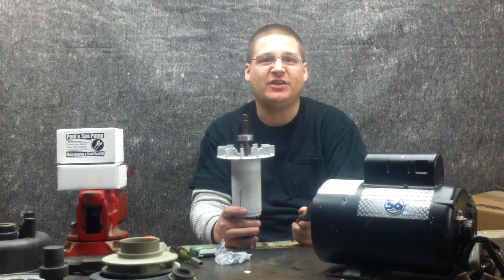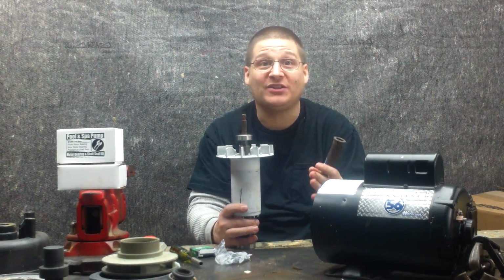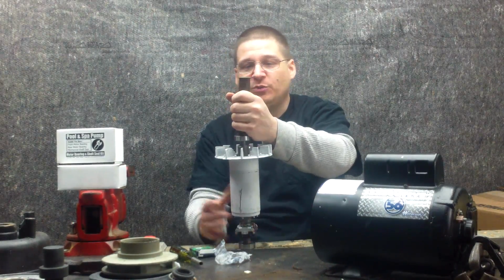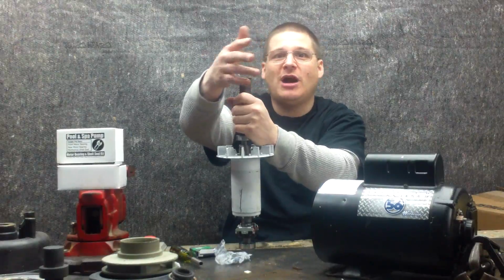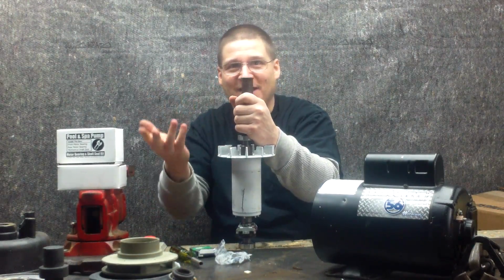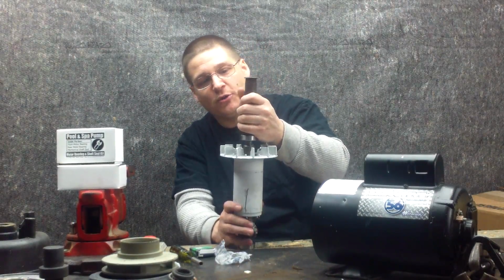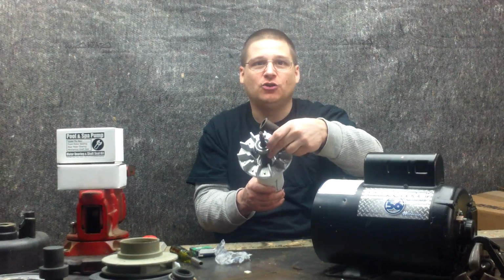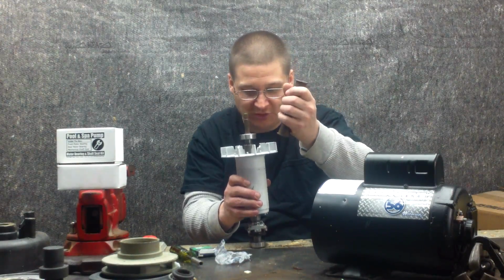Now, a lot of guys watching might think, oh, you need a press. You don't need a press, okay? Because if you use a press, yeah, it goes on, but at the same time, the press would just be pushing the pipe. I remember when I first showed Robert this, he's like, yo, dude, why are we taking like 20 minutes to set the press up, when we could be like, bam, bam, you know what I mean? Like, yeah, it's a good point. Because you're applying the pressure on the center of the bearing anyway. If you tried to push the bearing on from the outside, you could break that. But when you're doing the center, you're totally fine.